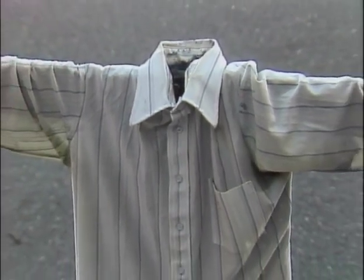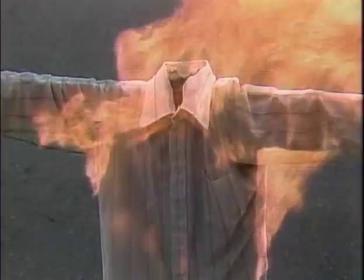Cotton shirts protect better during an electrical flash because the material is slower to burn and may not even ignite during the flash. When cotton does burn, the material falls away from the victim. Material with a high artificial fiber content, like polyester, tends to melt and cling to the victim, prolonging the burn and making it worse. Rubber protective gear, like these rubber gloves, is commonly used to provide insulation from current flow and should be worn whenever there is a possibility of coming into contact with energized equipment.